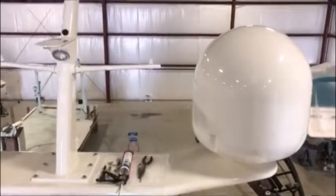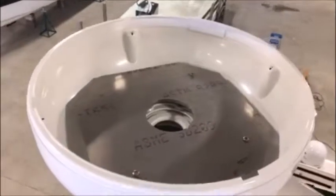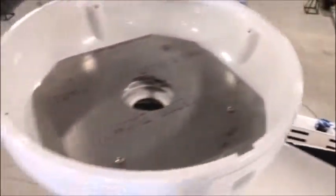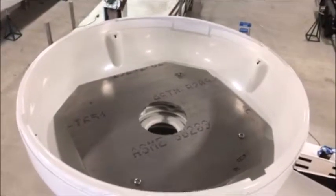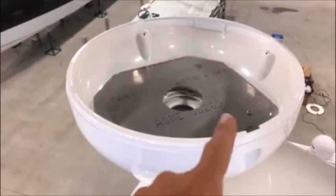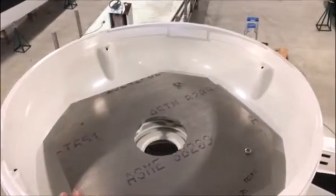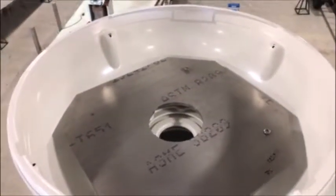Folks, we are back. I want to show you a little project I'm working on on the arch. This starboard dome is a dummy dome, but it won't be dummy for long because we are putting a V-SAT into it — you can see that dome down on the solar platform. The V-SAT antenna is considerably smaller, it's a 13- to 15-inch antenna, so it will fit very nicely inside this dummy dome which is 24 inches in diameter. We have to do some fabrication on the inside of the dome to provide a solid mounting platform for the V-SAT, which is even sensitive to harmonics on the boat, so it has to be something solid.